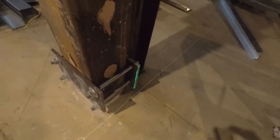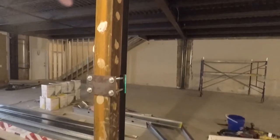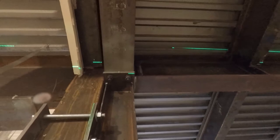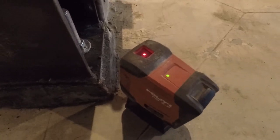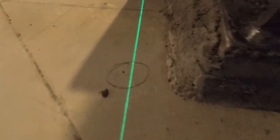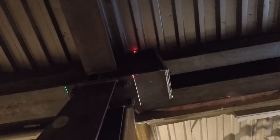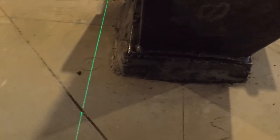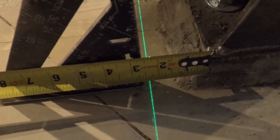To make these columns really, really tight — this is double layer five-eighths — you got to check where the steel is. The layout is the most important thing here. You got to check everything: every angle, every side. Check it with your lasers. I'm pin lasering, pinning down the corners of the column, because we want to be on the outside of that — the bracket up on the top. All you got to do is just laser everything, make sure it's all tight, because all we're going to use is angle and double layer five-eighths. Double layer five-eighths and angle is going to be so strong, you ain't moving those guys.